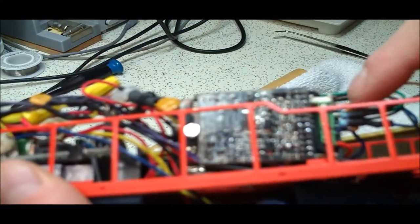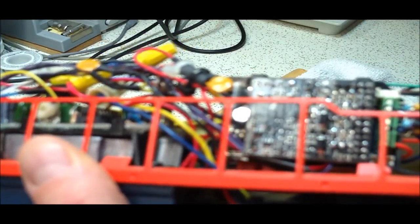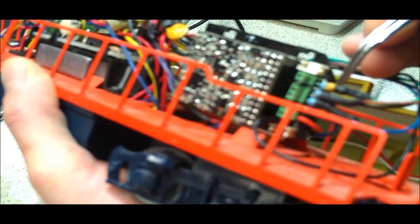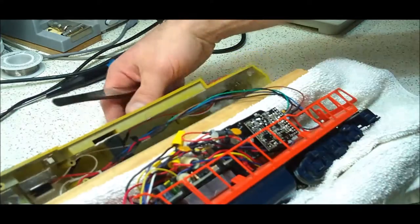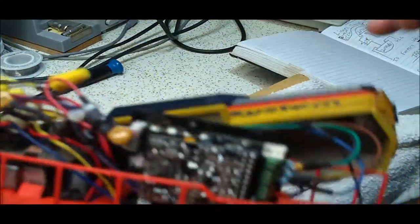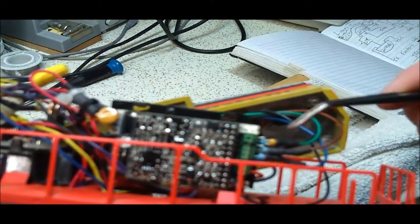On the Cruise Commander Light board, I have the common going to common here. I have 0.1 µF capacitors across the outputs as well. I found I needed both of those capacitors to reduce the flickering effect — 0.1 µF across the output and then the ground — and I have 820 ohm resistors connected on the output through the hot lead going to the LEDs.